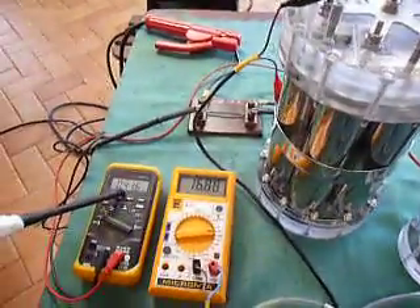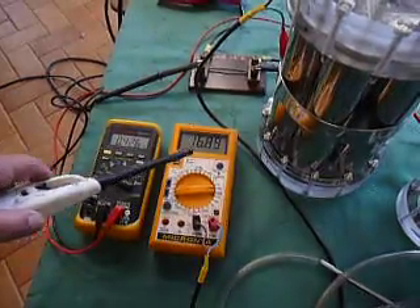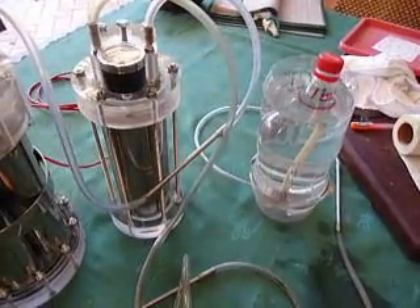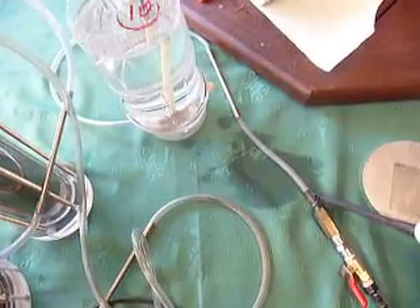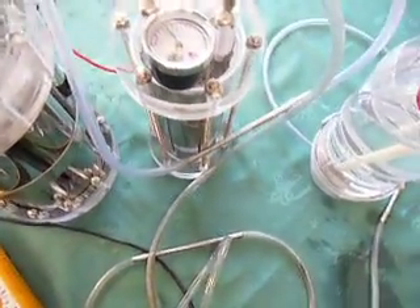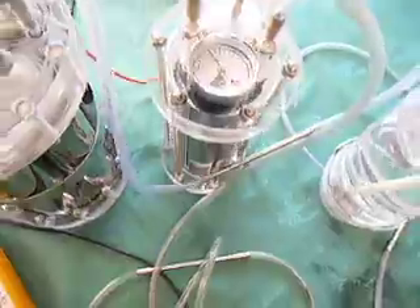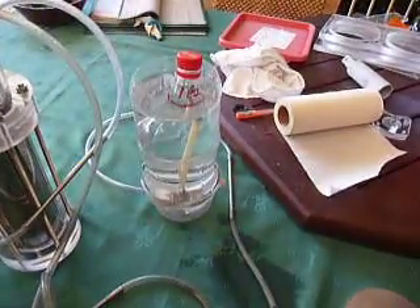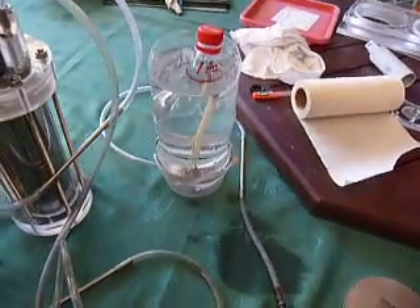The meter's changed scales now. That's 42 amps there, 16.8 volts across the cell — it's fairly bubbling away. Of course we're outputting the gas through a 0.6 MIG tip, which is restricting the flow. The flow is causing pressure in the system to build up — we're on about three and a half PSI. Check the flow again — up to 45.1 amps. I'll just count it in my head. About 20 seconds or so, so that's like three liters a minute, for 46 amps.